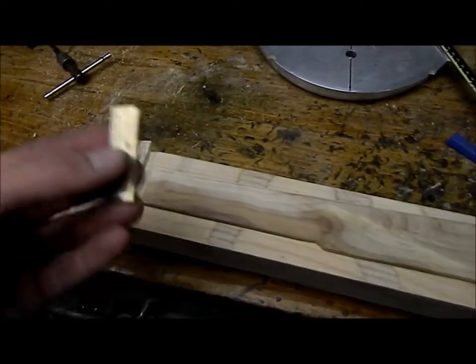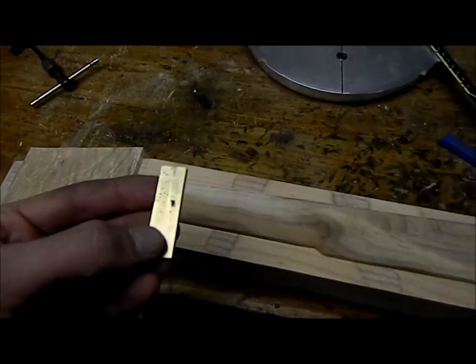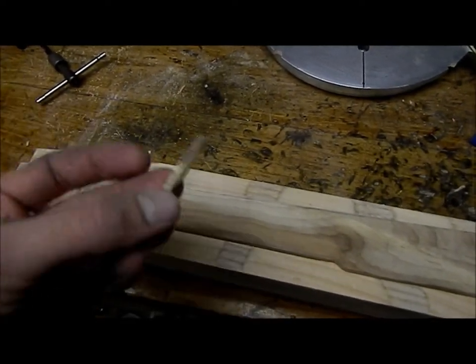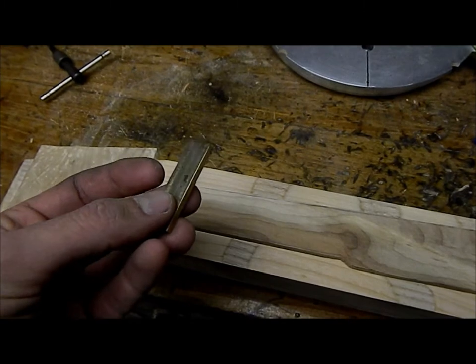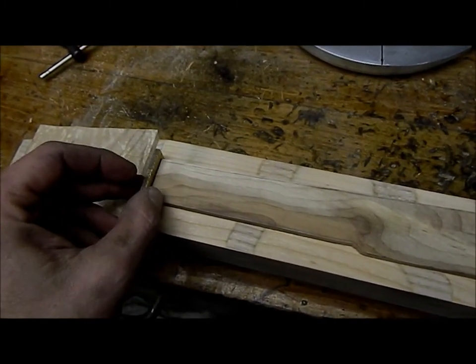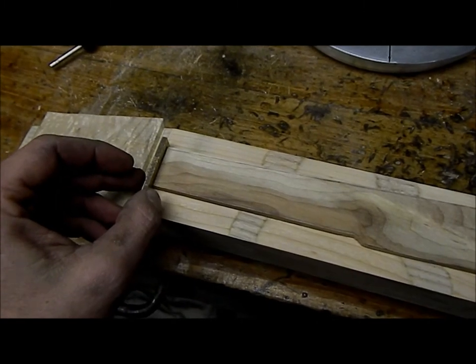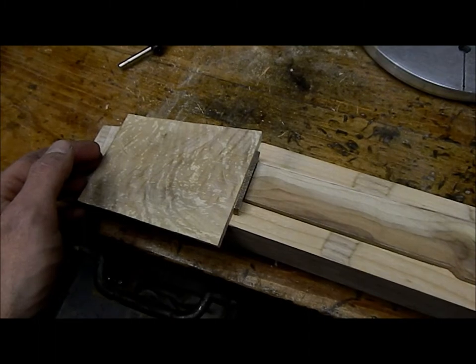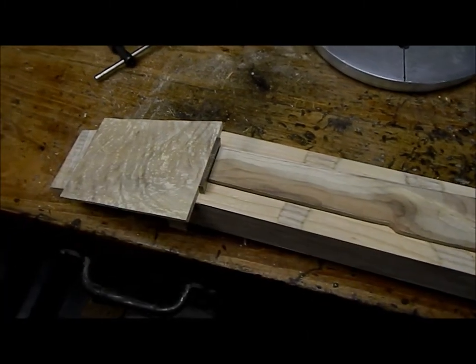And then my nuts, I make them out of bearing grade bronze. I don't make them out of brass. Brass is a whole different animal. This is a whole different animal. This is tougher and harder than a whore's heart. So it won't wear out on you. And we're gonna machine that. We'll make a nut, and then we're gonna put our peg head on. So I'm gonna glue fretboard and the peg head on and call it a night.